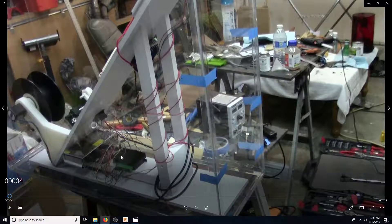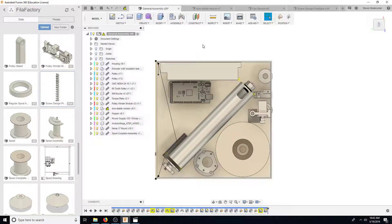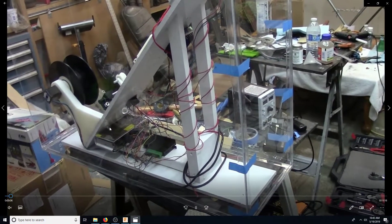This is a 12-volt, 15-amp power supply, which would probably be what we use for the project — it's modeled in here. I'd like to have the power supply inside because it's about 90% efficient, so it'll dump the extra 10% as heat on the inside to keep everything hot. That means almost 100% efficiency of heat on the inside of this box. I'd like to find a way to fit the power supply inside.